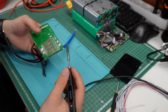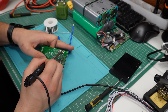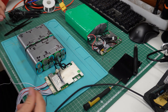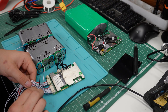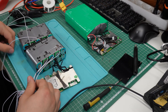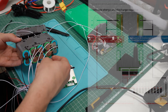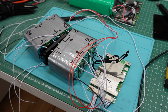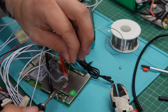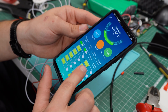Now I will start wiring the BMS. First of all, I removed the discharge wires since they were too short and I will be adding new ones. Since this BMS does the cell count automatically, there is a pretty specific wiring schematic for it. In my case, I started wiring the connector from the ground to cell 8 as usual, and then I had to connect cell 9 to all of these wires, and then the last wire from the connector goes to the positive side of my battery pack. I did connect it wrong the first time, so take your time to get to know the schematic a bit better. I connected everything without trimming the wires first so I can confirm all of my connections, and I also got the thick 12 gauge wire and connected the main power leads. At this point everything was connected, and I immediately took my phone to check the BMS app - the cell count was correct and all of the cell voltages looked right.